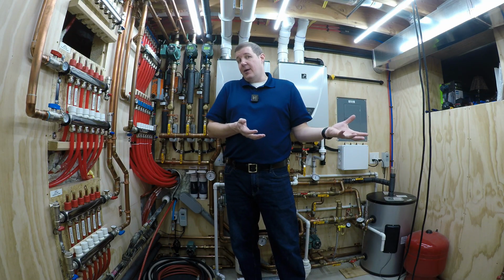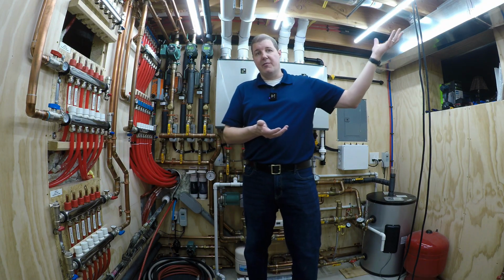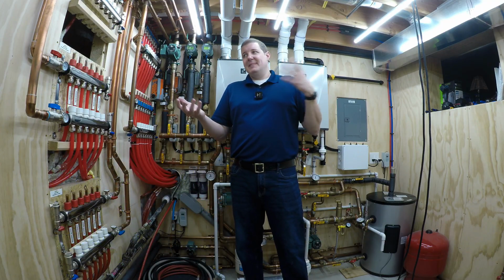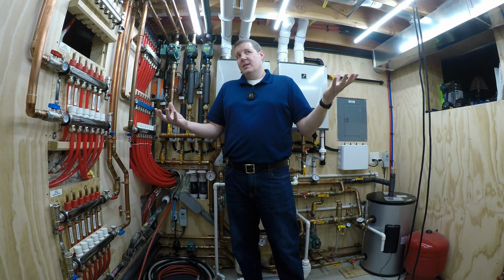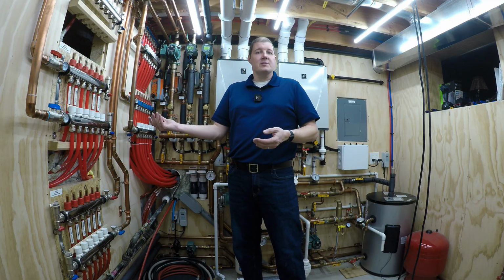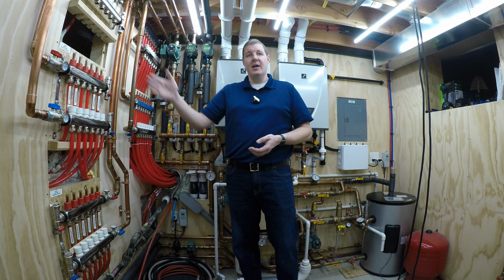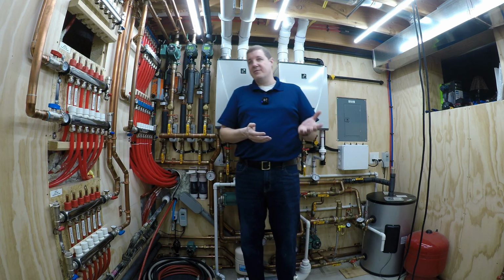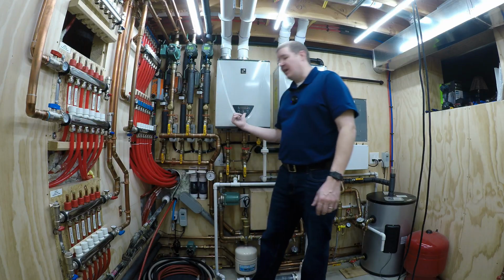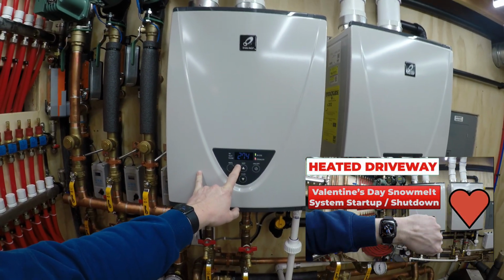Yes, 50 cents an hour is expensive, especially if you have to run it for 3 or 4 days like we just did for this big November 22 Buffalo storm. But, you know, that's it. Now, it runs harder and more expensive when it first fires up, of course. So when you first turn it on, like I was saying, and it's got to bring that cold slab up to temperature from 25 degrees to 45 degrees, you're going to notice on a lot of my startup videos that I've done, I do a BTU readout here.